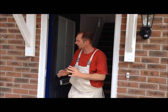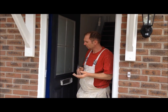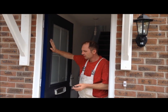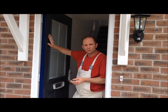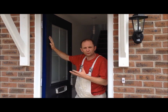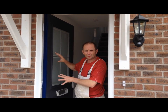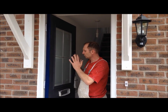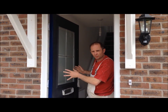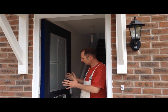Welcome back. I'm now at the stage where I'm going to gloss this door in Oxford blue. Like I say, you've got to prep the door, give it a coat of etching primer — some form of primer that bonds to plastic doors. Then I've undercoated the door as well. So it's etching primer, then undercoat, then a gloss finish.